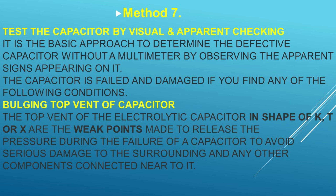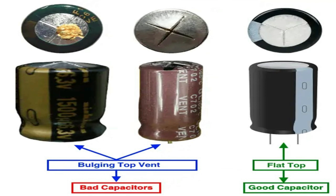Example: suppose we are testing a 16V, 470μF capacitor. If the supply voltage is 9V, then 5.7V is 63.2% of the supply voltage. Connect the capacitor to the battery for charging and start the stopwatch. When the meter shows 5.7V, stop the stopwatch. Suppose the stopwatch shows 4.7 seconds. Using the time constant formula: C = τ / R = 4.7s / 10kΩ = 0.47mF = 470μF.